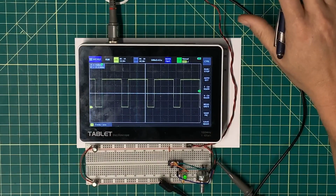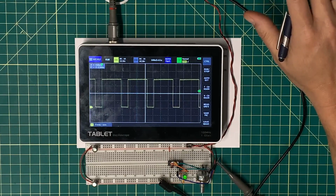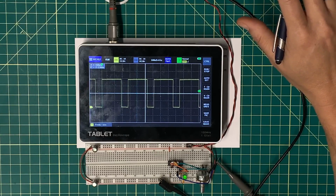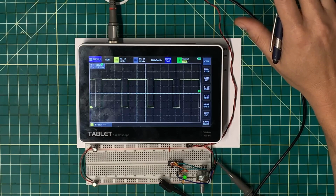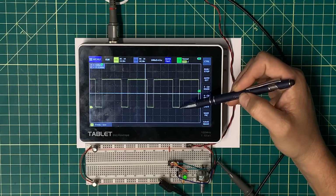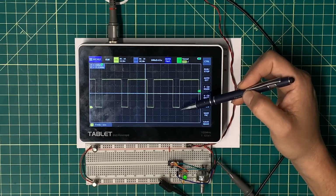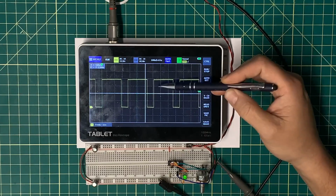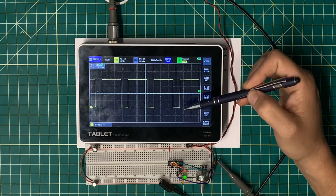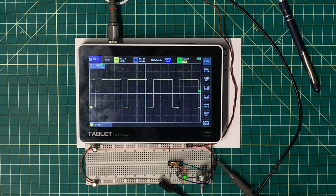And once again, what I'm looking at here is the sequence of how the signals need to take place. And I'm thinking about the program counter in particular. The increment and latch happens on the falling edge, which means that at that point it's got to update the EEPROM or the memory in order to get the new data out, and then that data, which would be the instruction into the fetch register, would be latched on the rising edge. I really think this would actually be a beneficial square wave and distribution of duty, if you will, if this were inverted. So let me throw an inverter in here and I'll demonstrate what it is that I'm talking about here.